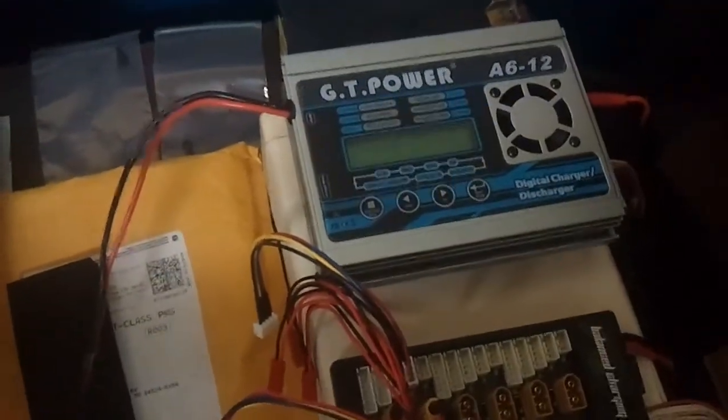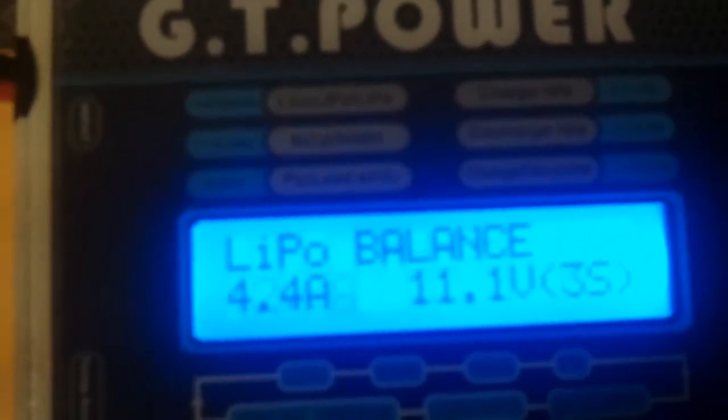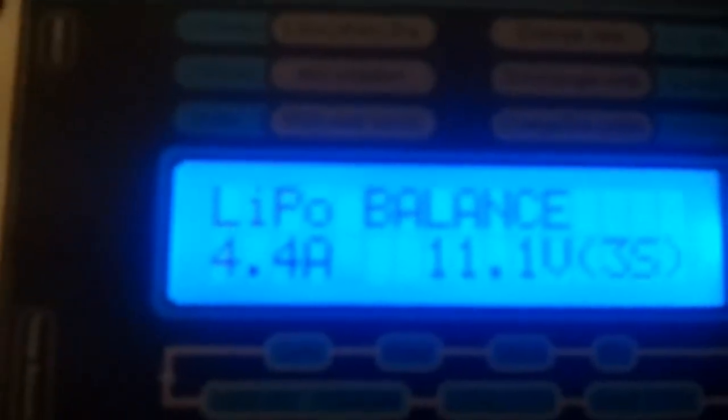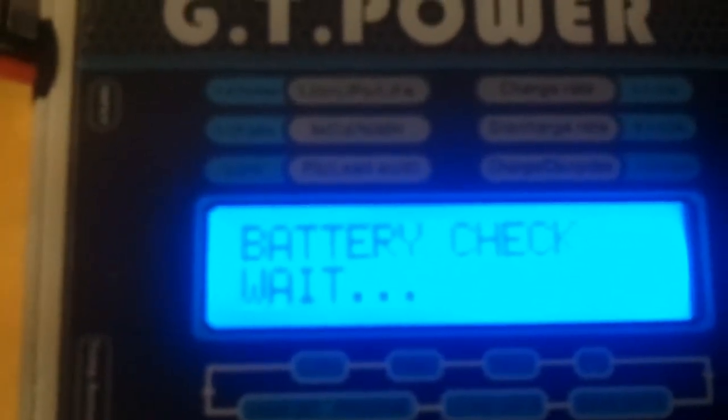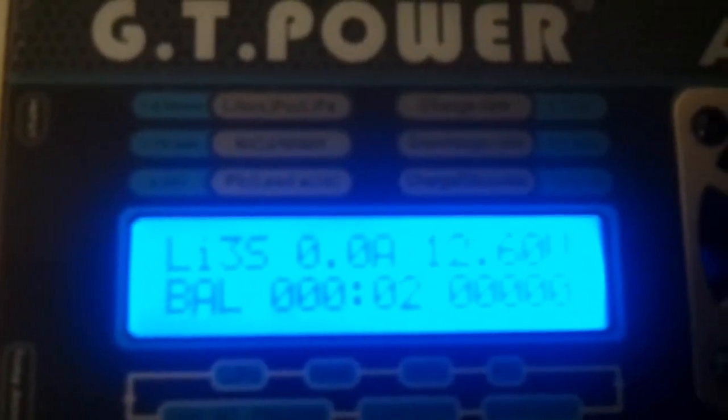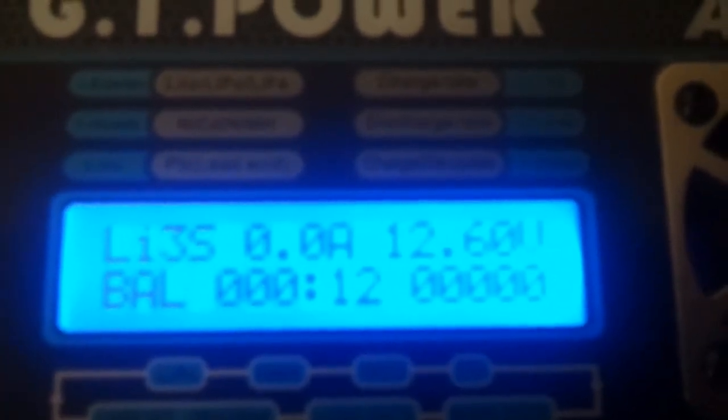I've left the charger off for several minutes. I have a regulated power supply here — I'm going to flip it on and the charger's going to come on. We're going to set it for a balanced charge at 4.4 amps, which is 2C of the Turnigy 2200 3S packs — 4.4 amps at 11.1 volts. I'll go ahead and OK that. You clearly saw that I had 4.4 amps chosen. And look at that: zero amps.